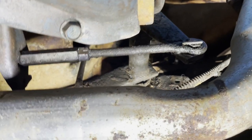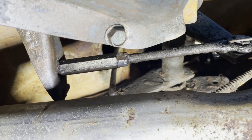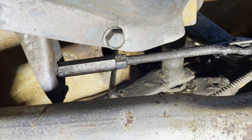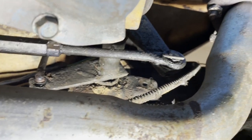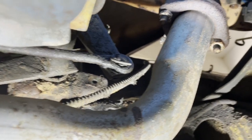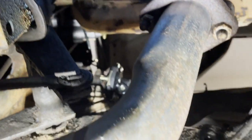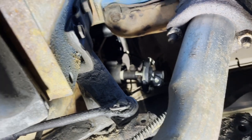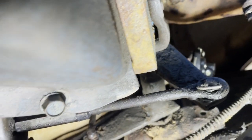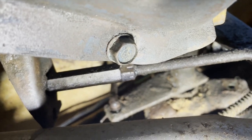While you're down here, you've got everything out of the way, it's a good time to work on this clutch mechanism. On the left side there, you can see where the rod pushes into basically a big lever. It comes across over here. There's a cotter pin holding that, then that piece goes up and connects to that assembly back on that side.